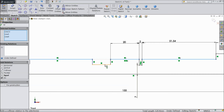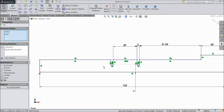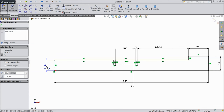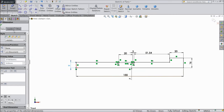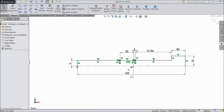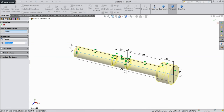The same as downward also, collinear. Choose equal: 2 mm, 2 mm. Again choose dimension, keep 9 mm. Now this center line select as a construction geometry. Now select revolve boss base, select yes. Click OK.